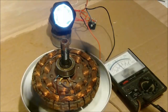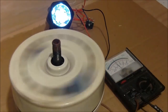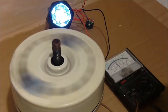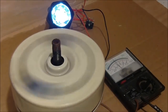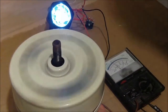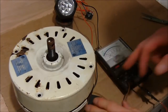The only thing is we're only powering 6 LEDs there, so it's very low wattage output. In my opinion, this small ceiling fan motor really isn't worth converting over to a generator because of the cost of the magnets. This motor only had an input wattage of 60 watts max, so you probably wouldn't be able to get even 60 watts out of it — so it really isn't a practical conversion. But if you can get your hands on a commercial sized ceiling fan motor, the higher the wattage of the ceiling fan motor input, the better generator you can build.